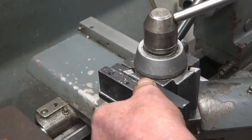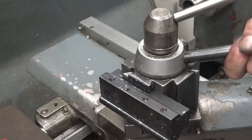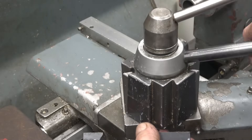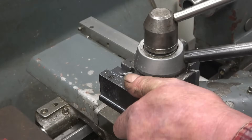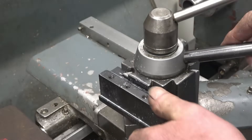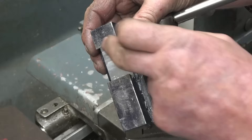Try it on. And unfortunately, I've taken slightly too much off it. That's not locking — that's the bottom of the wedge hitting the bottom of the tool post. So I have taken too much out of the slot. It's got it, but it hasn't got it properly — it's not solid. So basically, I'll have to build this face up.